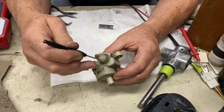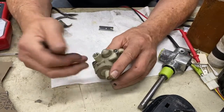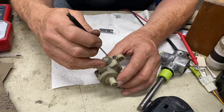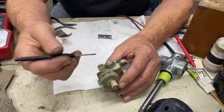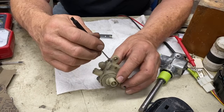It's interesting that this bearing support for the other end of the operation shaft right here has a sleeve on it that grabs a coil spring and lifts this pin up and down. It was leaking vacuum right here because this portion is snapped into place, and after years of differential shrinkage, it leaked out of there.